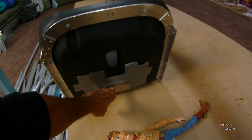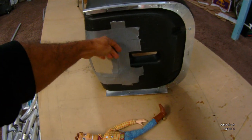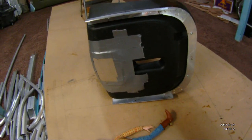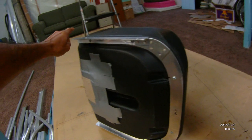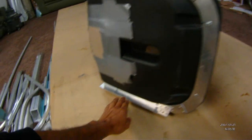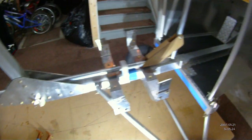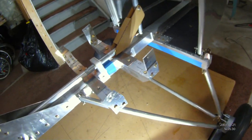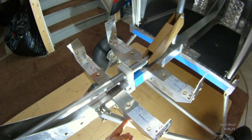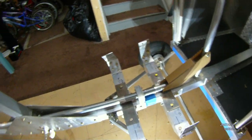Here's the seat rail I fabricated. There's a cardboard piece here because the seat comes with a big plastic piece at the bottom that I'm going to have to cut out — it's interfering with my design. This is the seat rail: aluminum angle, made all this with screws in six places. It's mounted using some two-by-two aluminum. It took a long time to get it to work out. I'm probably going to drill some one-inch lightning holes in here to take a little bit of weight. It's pretty rugged — I'm pretty happy with it.